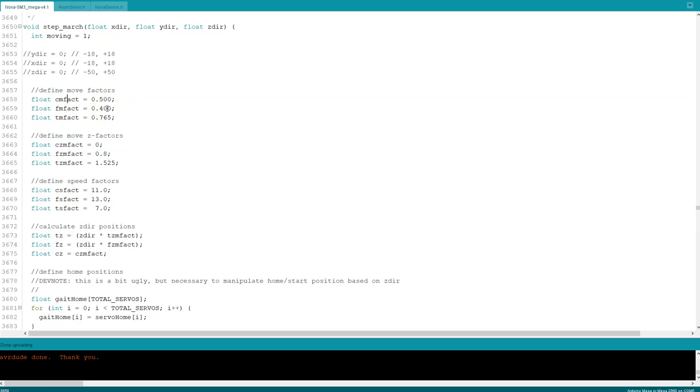My 'fake kinematics' is figuring out the ratio between the movement of the three leg segments to perform a certain movement. The march raises her leg up and down but also gives it a little circular motion. By using move_steps, increasing the step value increases that circular motion in either direction, which should move her forward or backward. It was an iterative process to find the ratio between the servos to make these moves.